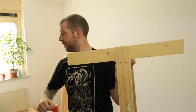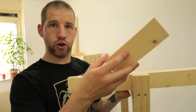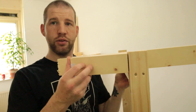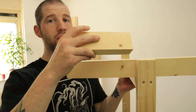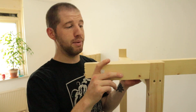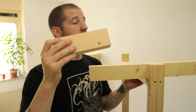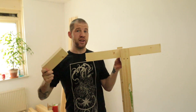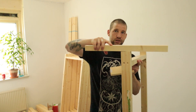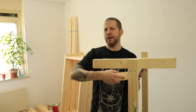What I'm going to do is add some extra secure parts over here, so it's going to look a little bit like this from the front. The reason is that the shelf is not only hanging on my screws but is also leaning on these extra support beams. These are actually going to carry the weight of all the setups, not just the screws. That way I improve the amount of kilos my shelving can take greatly — it will be much more secure. Also, having the standing parts oriented like this instead of like this will prevent a bit more movement. I think that will work — this is the first time I'm building a shelf like this, so let's see how it goes.